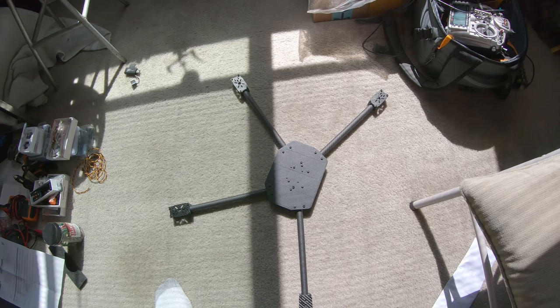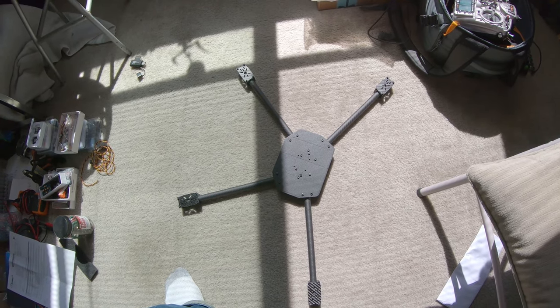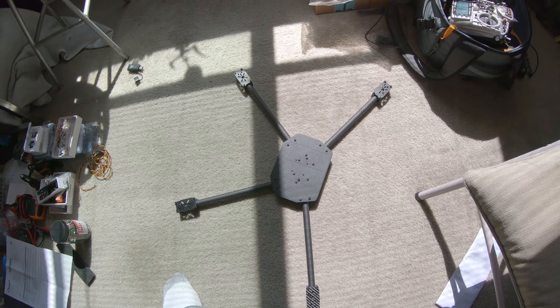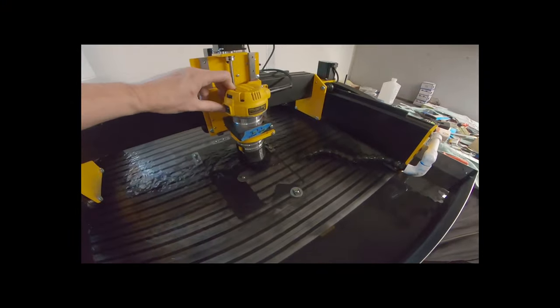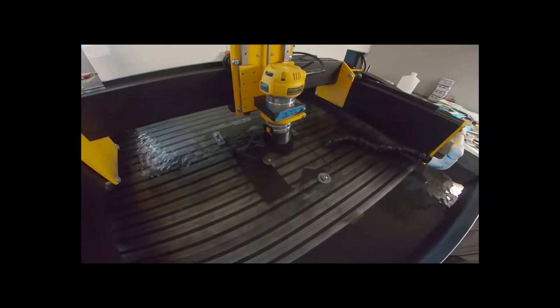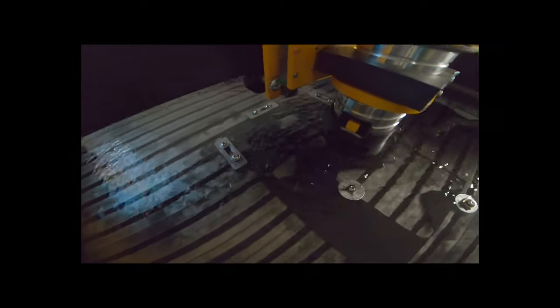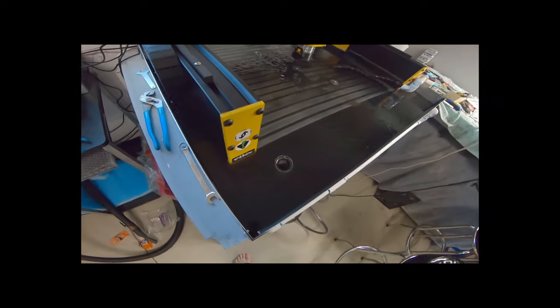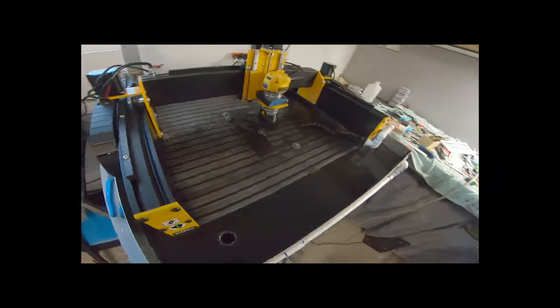I'm going to put a few videos up on the mill showing what the CNC is doing. It's set up to run underwater with water filtration - basically a dust-free environment. I don't have to worry about carbon fiber dust at all. I grab it in a filter, clean it up, throw the filter in a Ziploc bag and all my dust is contained. I just got done running an operation on a little three and a half inch frame and the water is extremely dirty from using a three millimeter burr bit. This is a waterfall cutting setup - all the debris from cutting carbon underwater is captured.